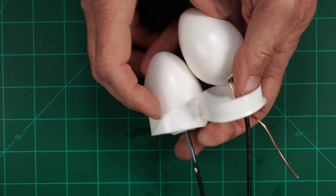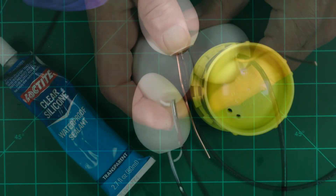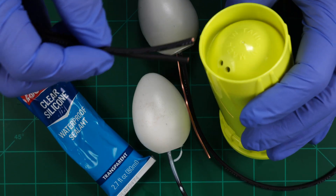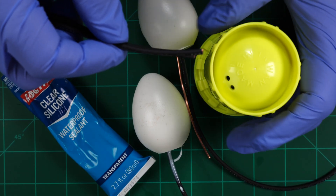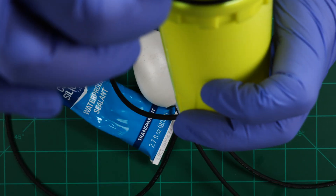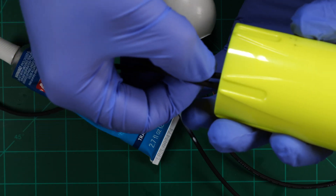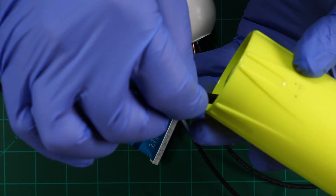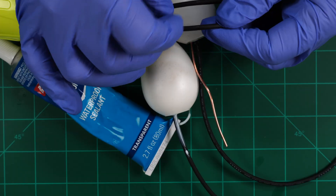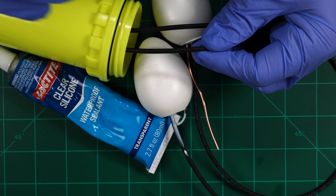Here are the hydrophones after molding, showing the overpour rings before removing them. Now we need to drill two small holes into the bottom of the dive case and the side of the waterproof case. These should be just larger than the wire. Then lightly sand the area around the holes with 220-grit sandpaper to rough it up. This ensures the epoxy sticks.